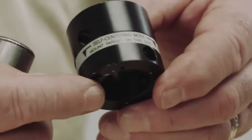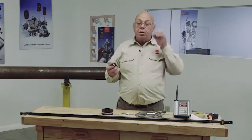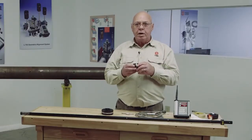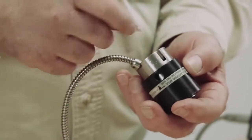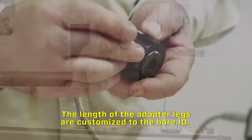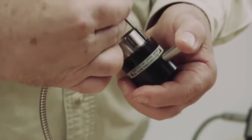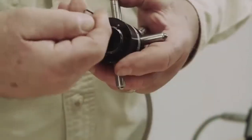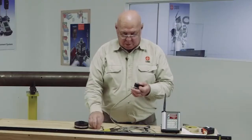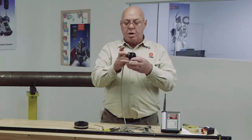On this adapter we have two sides: a self-centering mode and a measuring mode. When we do the alignment, we want to put this in from the self-centering side. The target slides into the adapter, and then we have set screws to hold the target in place. Now we have to put the legs in — I have to have the target in there, then I slide the leg in and tighten the set screw against the legs. Now the legs are pushed up against the OD of this target. This is what we call a true self-centering target with no moving parts.